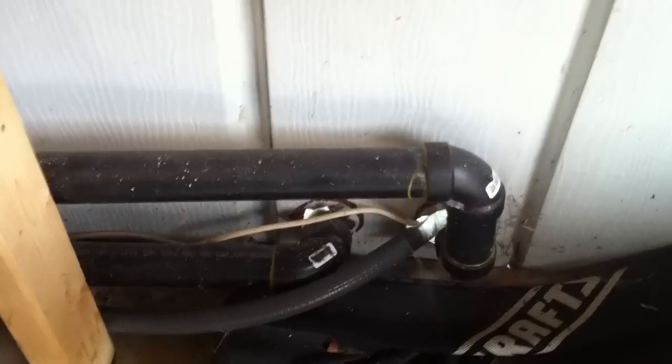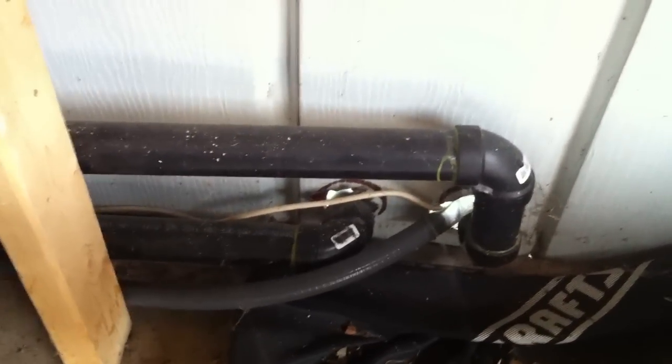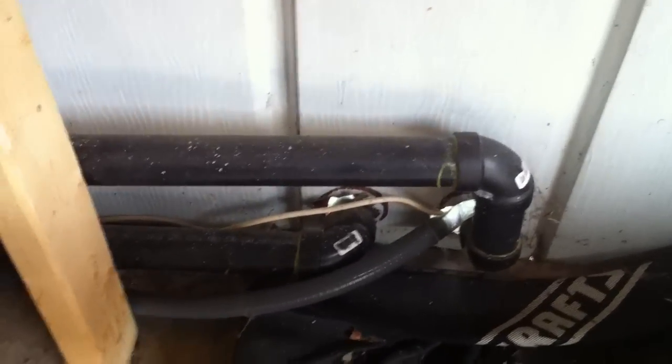We turn a corner and duck outside, where there's a heat pump — not a gas heater, but an electric-powered heat pump. It works similarly to a gas heater except it uses electricity and differential air temperature for energy exchange to heat the pool. Unlike a gas heater, you don't just turn it on and it cranks out heat — it can only work at certain times of year, needs lots of room to breathe because it can sweat liters of water a day, and needs good drainage and direct sunlight. In southern Ontario where I'm located, they don't perform very well, electrical costs are expensive, and these units require between 40 and 60 amp lines.